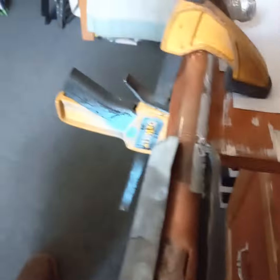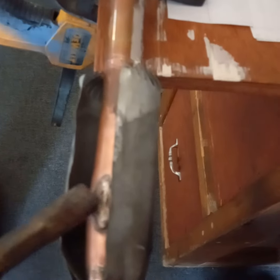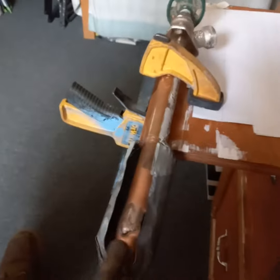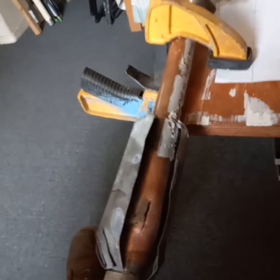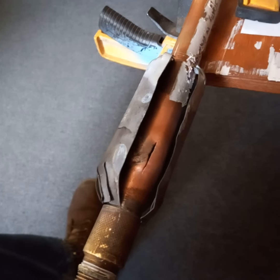I also like to demonstrate this heat trap — this is a Klingon heat trap. It's a piece of sheet metal with its edges feathered in. With it, it holds the heat in and we can scoot our torch all the way around the joint, just spin that trap as we travel along. With a MAP torch with a pencil tip, we can get that pipe hot enough to braze without the complexity of the oxygen acetylene torch.